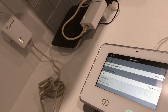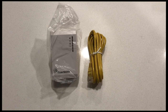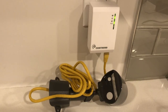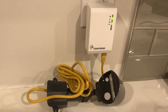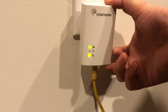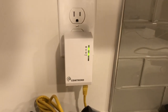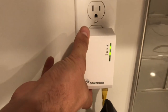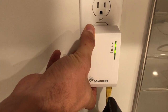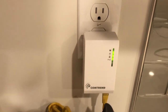Once your connection goes through to wired, sometimes it will remain on 'disconnected' for a few minutes, but it'll eventually swap over to 'connected' and you can verify that with a test. Moving on — the PLC with PoE as seen on the screen — we're going to use that to connect up a camera. Once the camera is powered up and flashing green, link the PLC units by holding down the panel PLC for three seconds, then do the same with the camera PLC. It's recommended to learn in the camera with a pre-made ethernet cable that comes with one of the PLC units, and make sure you're using the same outlet you'll use once the camera is mounted — this verifies that the PLC unit is on the same circuit as the panel so you'll know if the install is going to be possible.